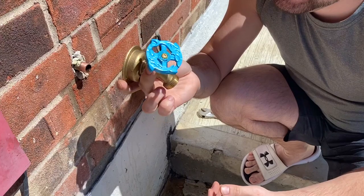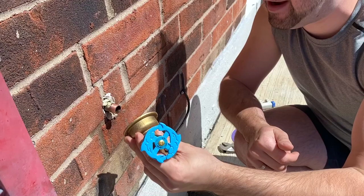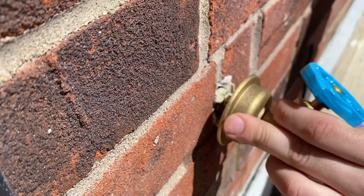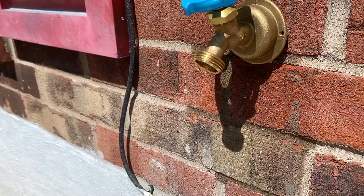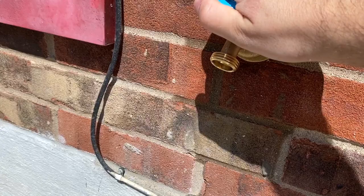With this shark bite faucet, we are simply able to pop it on and we should be ready to go. This is what makes this job super easy — anybody can do it because it is extremely easy. You do not have to solder anything. It is just pop and go, and that is why I like these shark bite faucets. Now we're going to pop it in. You want to make sure this white circle goes inside of the pipe. After you push it on tight, it will look like this. Now you have a brand new faucet installed on your property. As you can see, there's no leakage whatsoever. You can also add two screws here if you really want to attach it to the property, but it is on strongly so you do not have to.